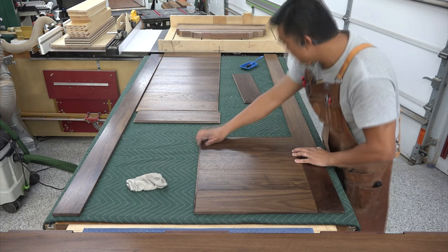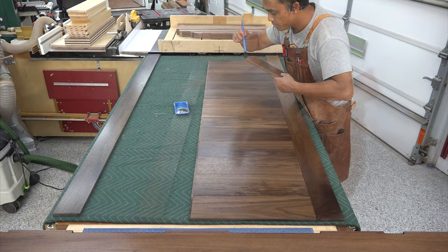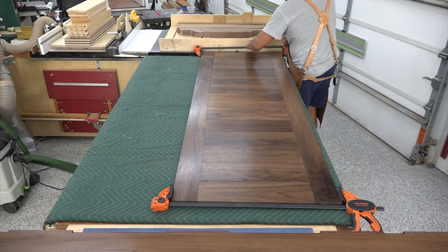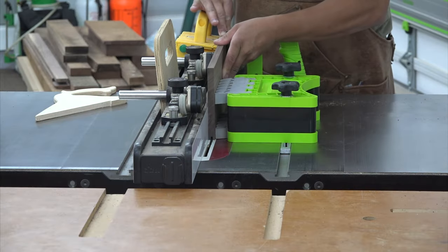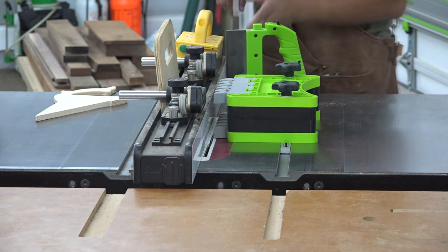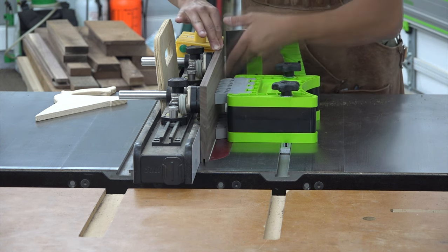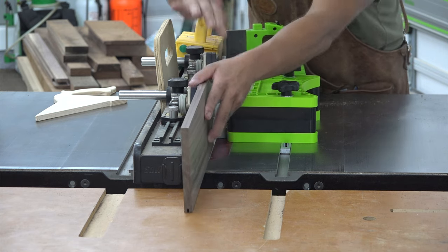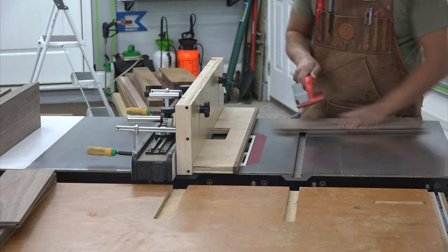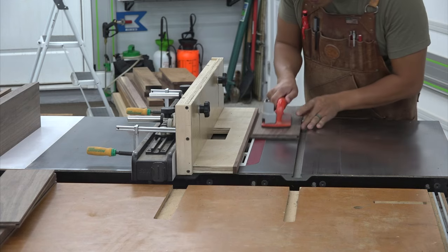The back of the sideboard is made of solid walnut and is essentially the same as a tongue and groove frame and panel door. There are a pair of rails and a pair of stiles glued together to make the frame, and within that frame are multiple undersized slats designed to float within the groove. To machine the groove in the back slat I ran stock through a flat grind blade along its edge, rotating the board 180 degrees during the second pass to ensure the groove is centered. To machine the tongue I used a dado set and an L fence, taking a pass on each face of the ends and then on either edge, giving me a perfectly centered tongue and groove joint.